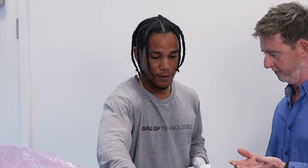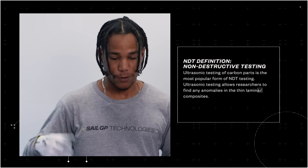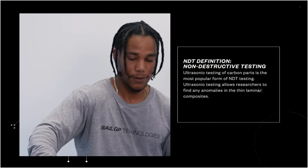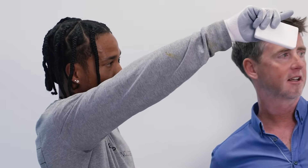And there's no voids in it that can then break? That's exactly it. And then it will get NDT'd — they'll come and scan it to make sure there's nothing wrong. So NDT is a scanner? Yes, they'll make sure there's no pieces of material underneath the carbon, and no voids. They'll either say it's good or not good. So next stage is the oven? Yes — that's the big building over there to the left.